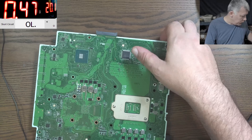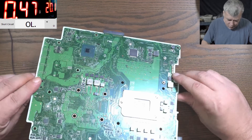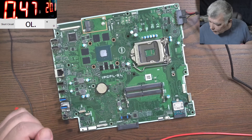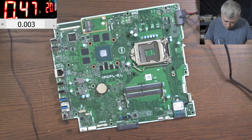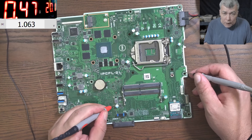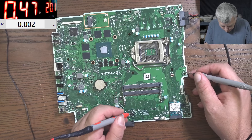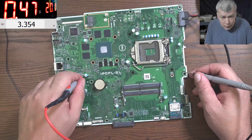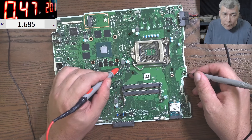We can check the voltages on the power supplies. Obviously the board will get stuck without a CPU — it can't pass POST, and we don't have CPU or RAM. But the fault was clear: a shorted capacitor on the main power rail. Here you have 1 volt, 3.3 volts for the BIOS chip, and then 5 volts.